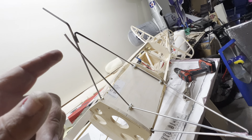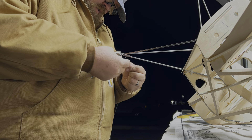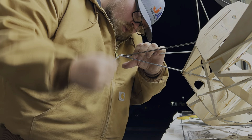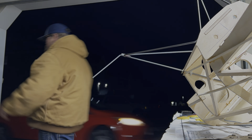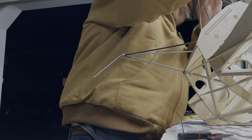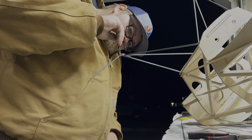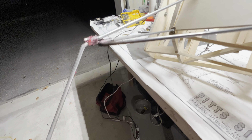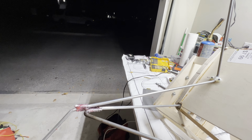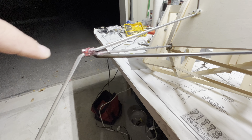We're gonna go ahead and wrap these all up and then solder it up. You can see we've got a bunch of flux on there and they're all wired up. What I'll do is heat kind of back here and let the solder flow up — heat's there, solder back — and we'll get her done.